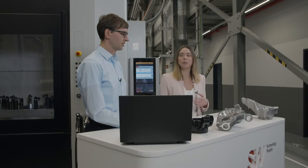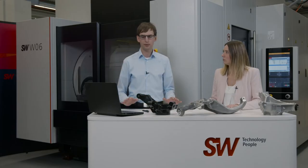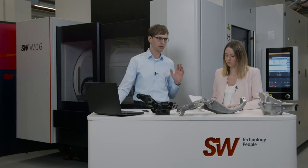What is the clamping like? There are different concepts. Very often, knuckles are only manufactured in one clamping setup, but of course there is also the option of manufacturing in two clamping setups. I'd like to show the viewers a few things. We have, for example, a cast iron knuckle. This workpiece has an OP-10 and OP-20 solution with two setups on the fourth axis. We see a total of six components here.